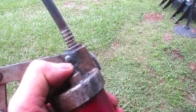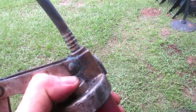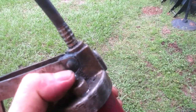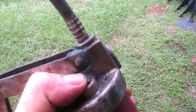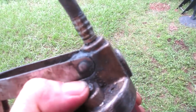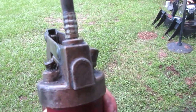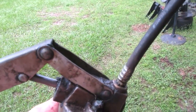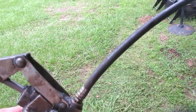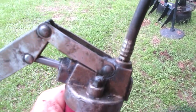This one over here actually has a button to push that'll let the air out too. You might just do that until the grease comes out of that hole. Once you start pumping this thing, it'll generally pump all the air out anyway — but it's nice to get all the air out before you start pumping grease into things.